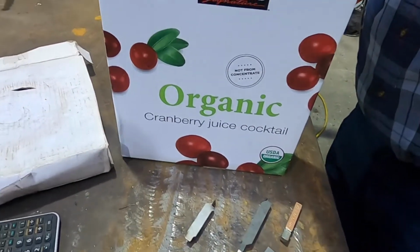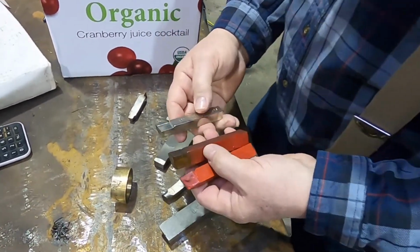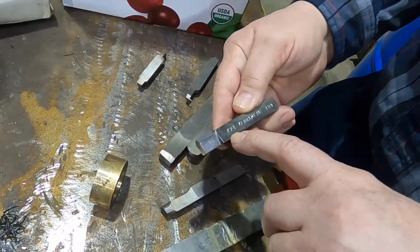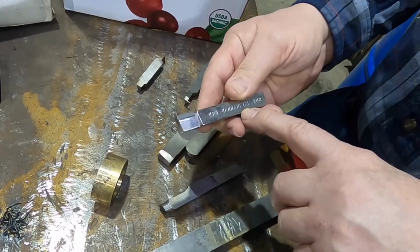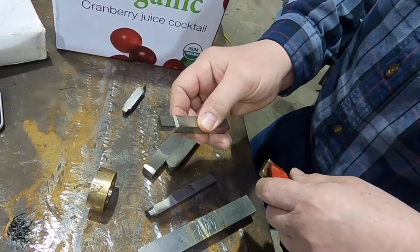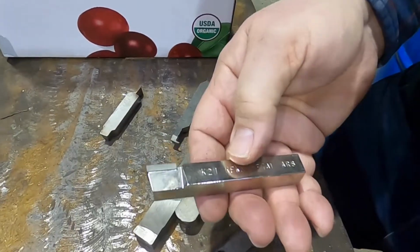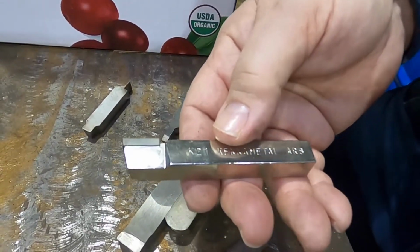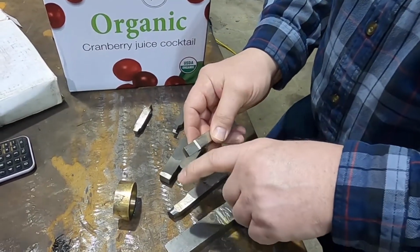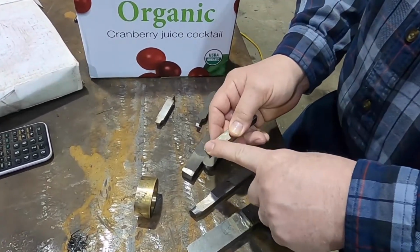We have got carbide brazed on, this is where they started with the carbides. And the K21 Kennametal, the actual K21 Kennametal, is an extremely good brazed on for brazed on tooling, which is antiquated. I have not been able to find many of these. These are rare. There's a lot of them that will reference the K21, which they basically are meaning just a C6 carbide, but the specific K21. Now you can buy K21 inserts that you could braze into a piece of steel.